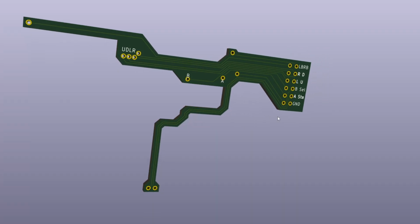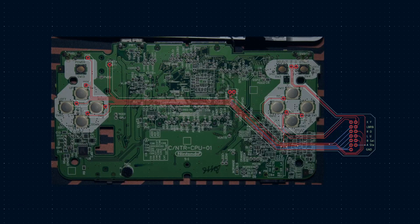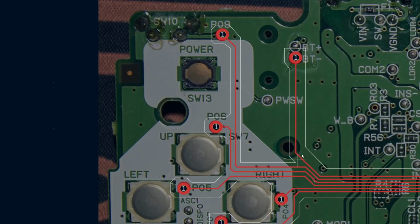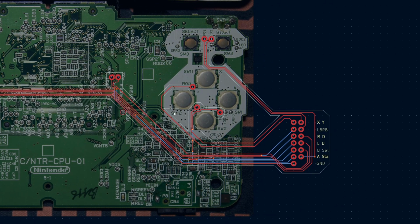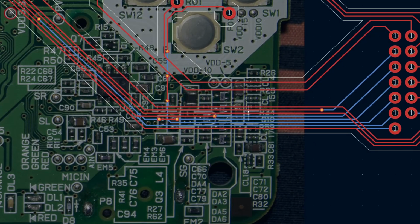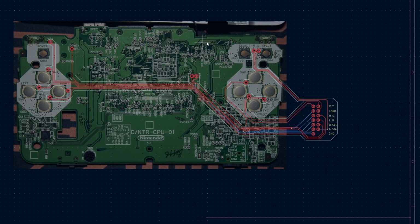And here we are, I finished both boards. This is the Game Boy and this is the DS. For the first versions, I have the connections hanging out the side of the consoles here, and I've made sure to use the same pin layout for both consoles, with the DS having the two extras at the top, so that the code can be used seamlessly between both consoles.